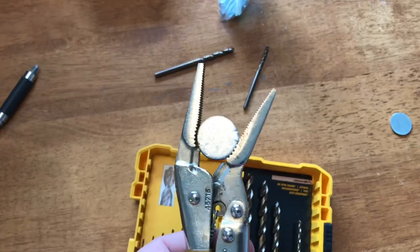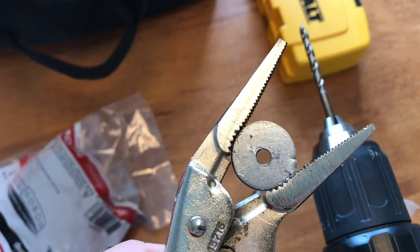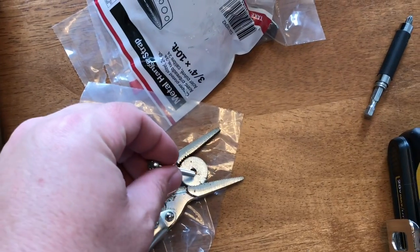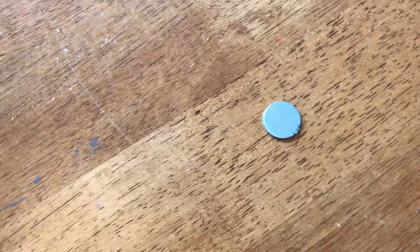Let's go inside and fasten the pipe for the sump pump into the wall. Everything is strapped up outside. Next is to go downstairs. I've got the tools I'm going to use. Instead of going through the garage looking for washers, I took an electrical box knockout — the little plugs you punch out — and I'm drilling some holes in them to use as washers on the strap downstairs. I've locked one into some vice grips to drill the holes through.